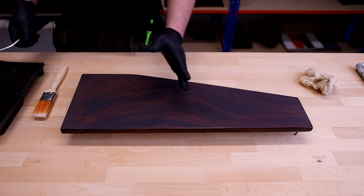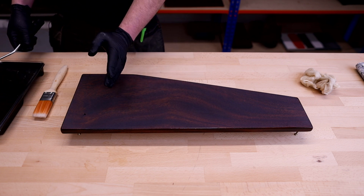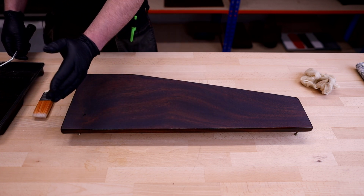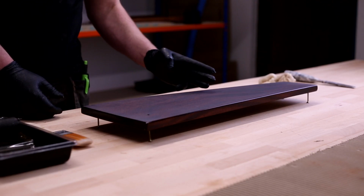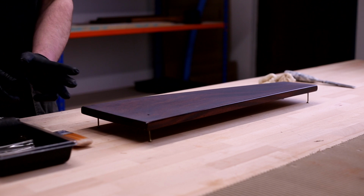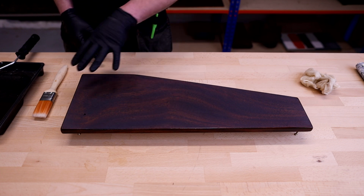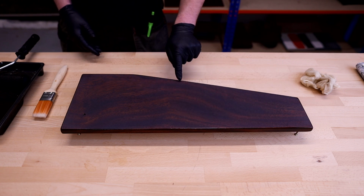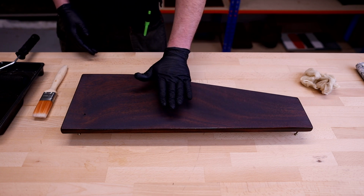The idea with tipping is to try and feather both ends of the section that you're working in, as well as smooth out all of the bumps and bubbles in the main body of the section. I'm going to roll up to this section here, and when I start to tip, I'll actually start in the dry section and come into the wet varnish, through and then out. That feathers out this leading edge, which means that if I've got a big area to do and I don't get back around to this section very quickly, it reduces the chances of me having a hard line here. If this is feathered out, it's going to blend more nicely into the next section.